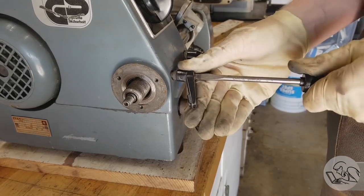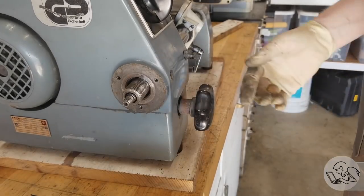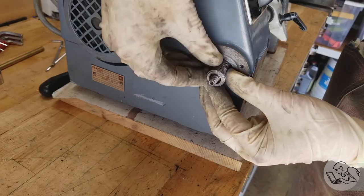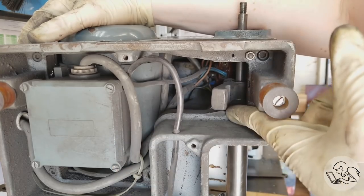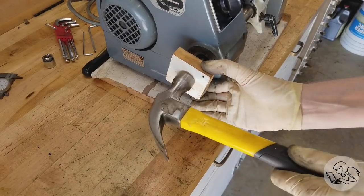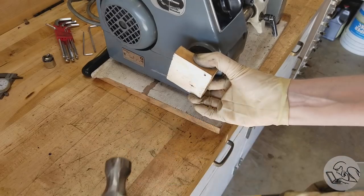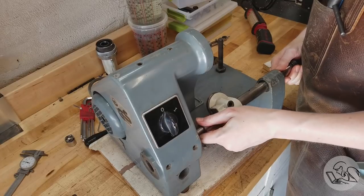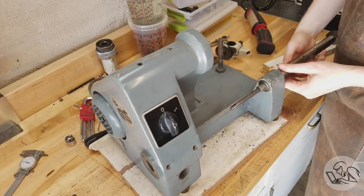Now I'll take these locks out — they keep the bar from moving while you're grinding. The big knob is a rotation stop, and we'll take that out as well. Now this piece slides right out and there's another thrust bearing behind that. There's an angle stopper on the inside with nothing holding it in place. I removed a set screw from that, so now the bar should just tap right out. And we can see that it's moving — it does in fact come out now. We can slide the remaining piece of the workhead off of there. And Bob's your uncle — we got that bar out.